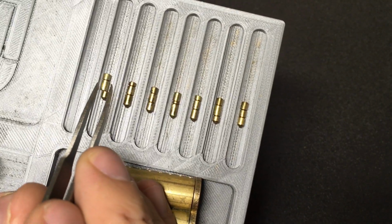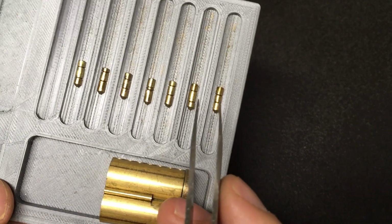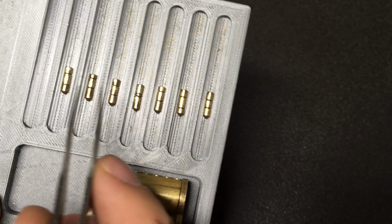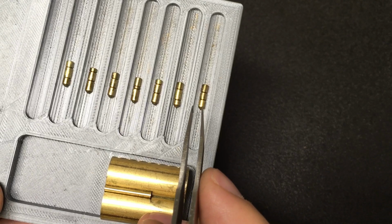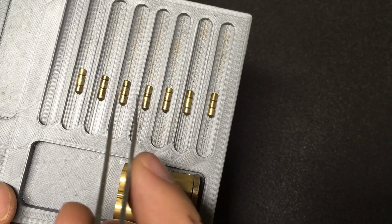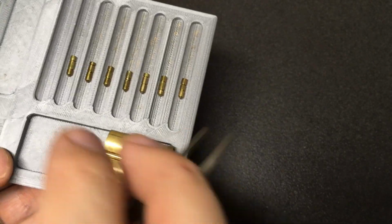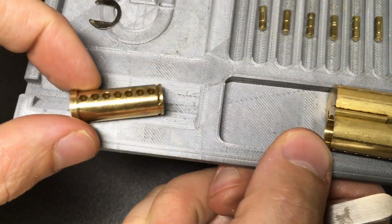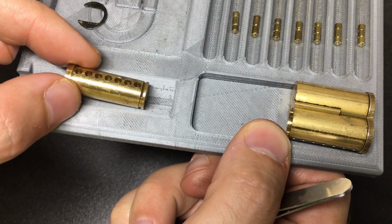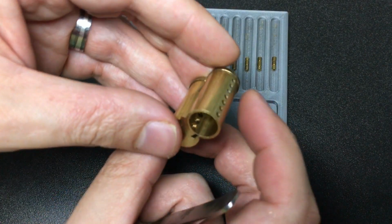And what you'll see is that you have equal heights of all the pins all together. Okay, not the key pin plus driver pin 1. That isn't an equal height, not at all. It's just that when the key is inserted, plus the height of either the key pin alone or the key pin plus the first wafer, depending, needs to just clear this first shear line to basically operate the lock, and the second shear line, which I'll show you here, to operate the control mechanism.